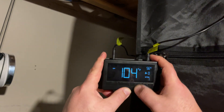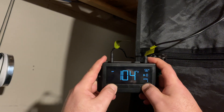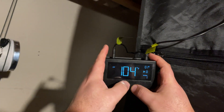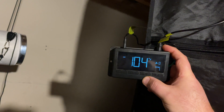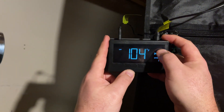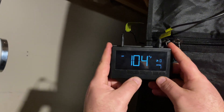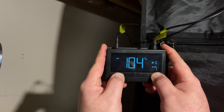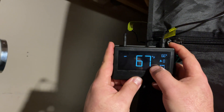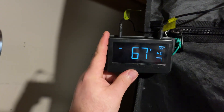That's how you do the negative for both humidity and temperature. To get to humidity, push and hold the two outside buttons and wait — it switches modes. You can see top right-hand corner. I already have it set to minus one because mine was off by one. Same thing: go up a percentage to increase, or go down past 100 to 101, 102, 103 for negative values. Once you're done, push the two outside buttons to save. The humidity jumps right away — mine went to 65 immediately — and then the temperature adjusts slowly. That's it. Now you can calibrate your unit.